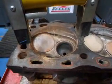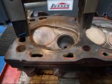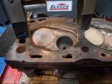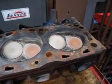So unfortunately, this head is unfit for service. We may be able to repair this crack, but more than likely we'll probably just replace the head. I'll go ahead and get the other three cylinders done to verify that there are no other cracks, but at this point it looks like the head is unserviceable.